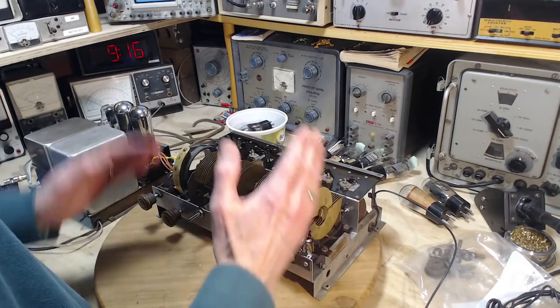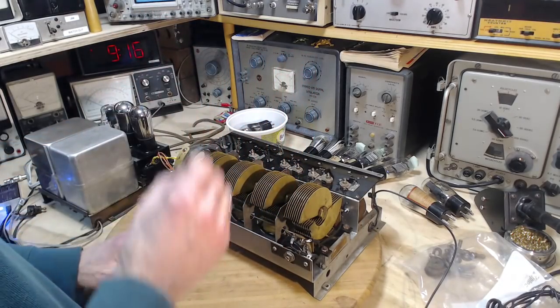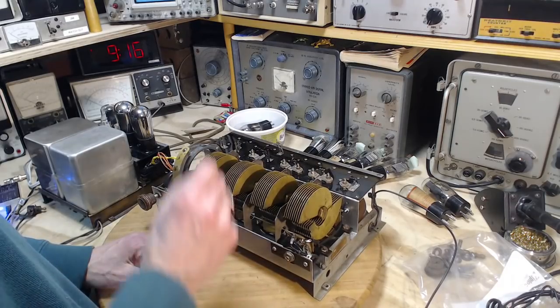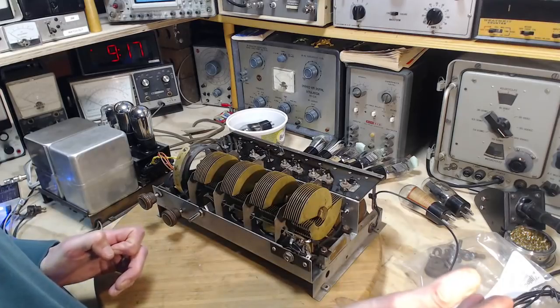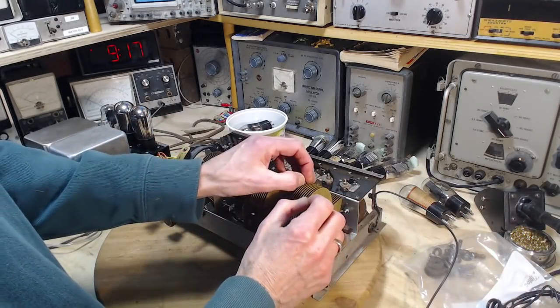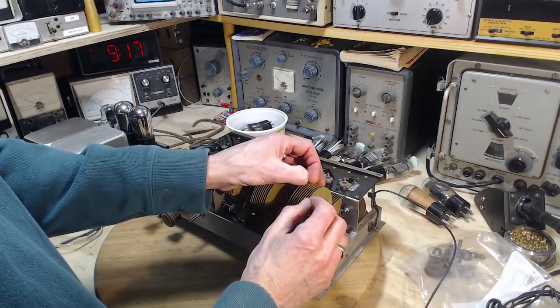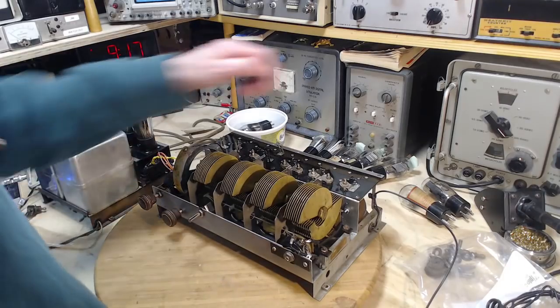There comes a point where doing that will cause the bandwidth to get so sharp that you will only hear a muffled response in the speaker. So there are limits to this, and besides, if you got 6 of these in a row, good luck getting them all lined up and tuned properly. It's hard enough with this arrangement.